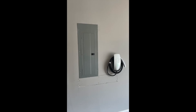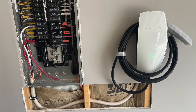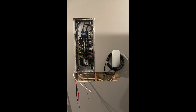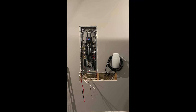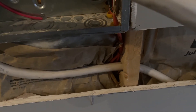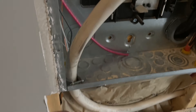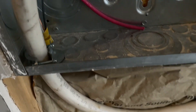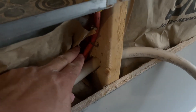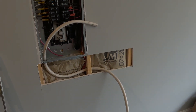Here's the finished product, folks. Looking at the panel on the wall — I put the drywall piece back and patched up the hole. Going to leave it temporarily to be finished later after we install our pool in the summer. It was a pretty easy project, took me probably two hours. It was more research — figuring out the supplies that I needed. I used a spade bit right there to drill into the wall, marked my drill spots with the template that was provided, and used a wire connector right there, that metal connector. I positioned the wire through the stud bay.